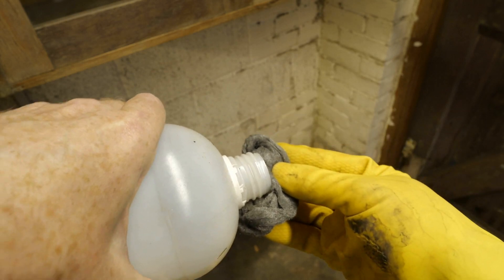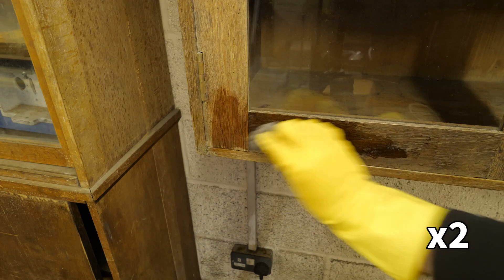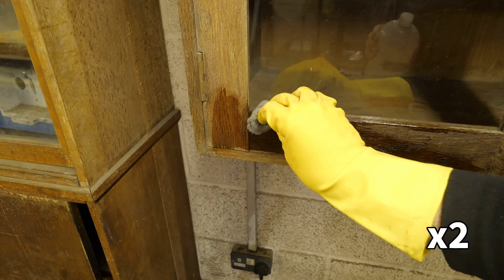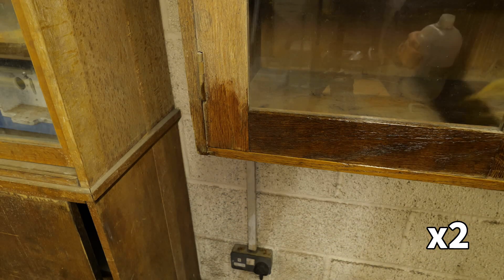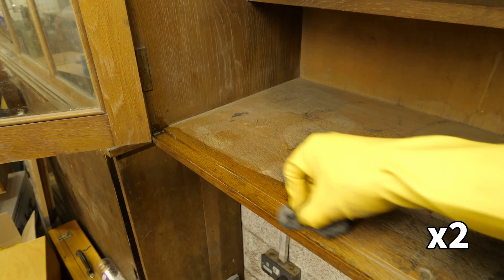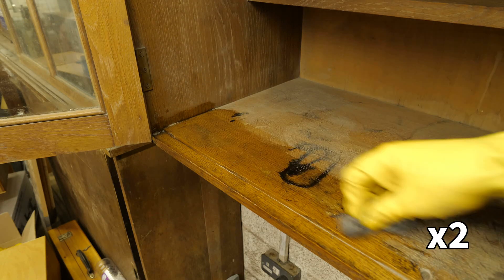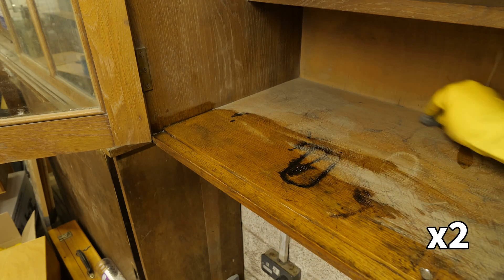Now the surface is clean, I'm going to rub it down with white mineral oil. The immediate effect makes the wood look fantastic, but this is only temporary as long as a film of clean liquid oil clings to the surface. This is very purified mineral oil, available from aromatherapist suppliers, and it soaks into and rejuvenates the wood. It's very effective on older hardwood furniture with traditional shellac-based finishes, but is also compatible with more modern finishing oils. It's particularly beneficial for furniture that's old and abused enough to have lost its natural tone, and it also helps replace any oils removed during the rub down with alcohol.